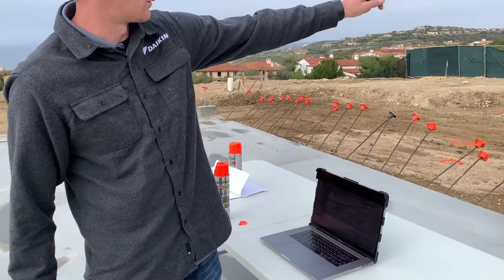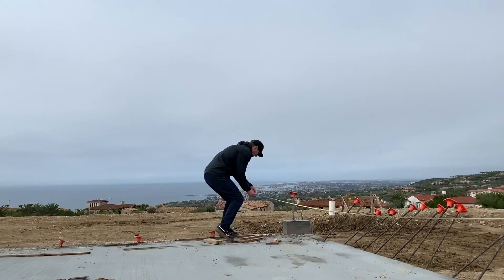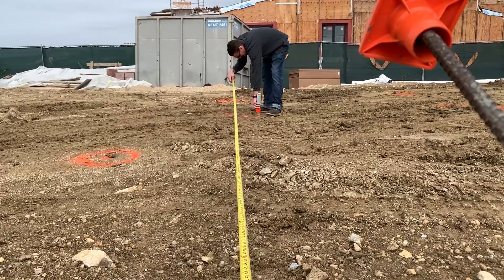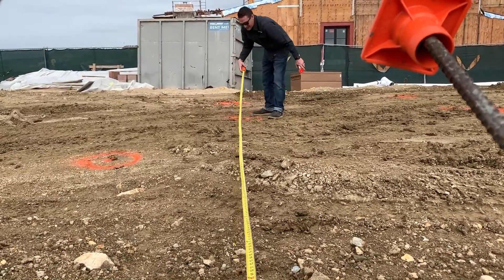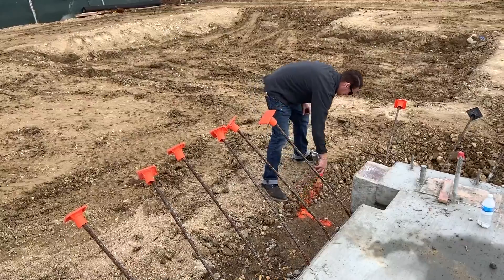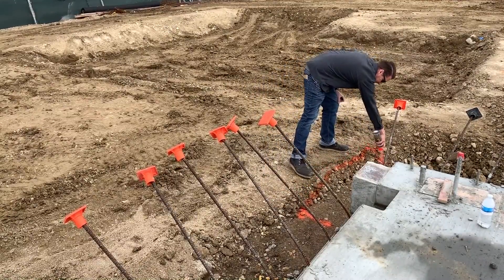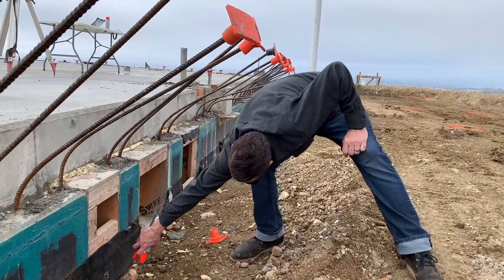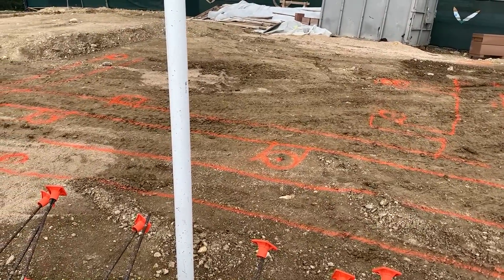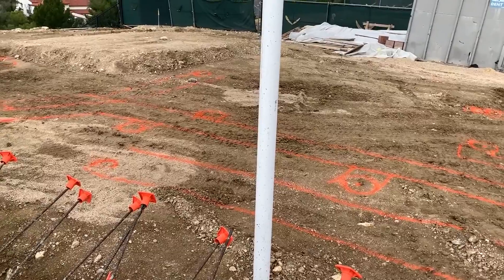In order to ensure perfection we have to lay these things out perfectly. We only get one shot at this so every detail is considered. We carefully measure and mark the soil so the trenches can be dug to fit our duct system perfectly. The trench will be dug at two feet wide. This will give us just a small amount of adjustment for when we do the final layout with the laser. Our duct design is nicely laid out on the soil and ready for trenching.